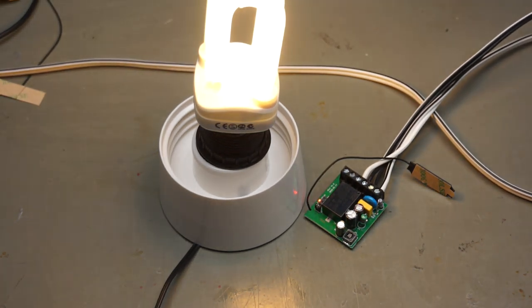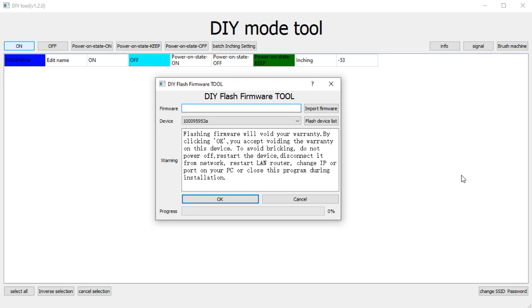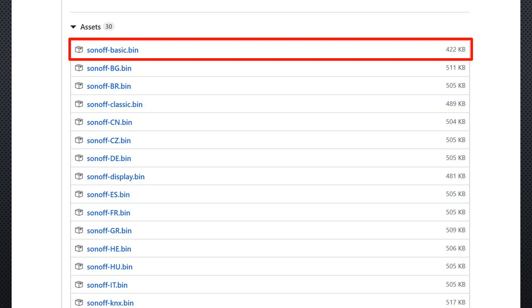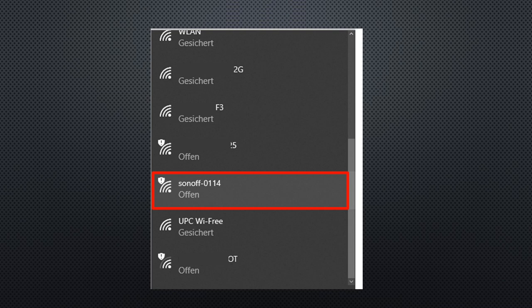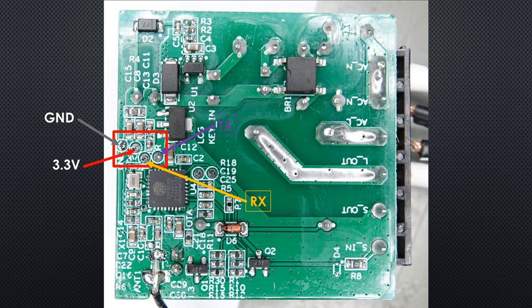Now we are done with this proprietary eWeLink software and say goodbye. Now we are ready to brush machine — which in reality is a bad translation meaning flash firmware. Be aware that there is no way back if you import the appropriate Sonoff BIN file and hit OK. You find a link to the BIN file in the description. The Mini gets its upgrade into the free world. If we connect to the newly created access point starting with Sonoff and open 192.168.4.1 in the browser, we get the well-known Tasmota screen. The relay is on GPIO 12, as in the Sonoff Basic. And if everything fails, you still can solder 4 wires to the respective pads on the PCB.